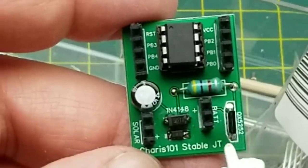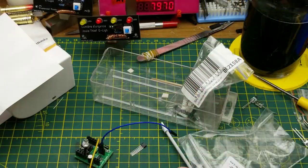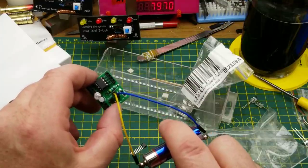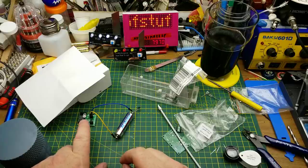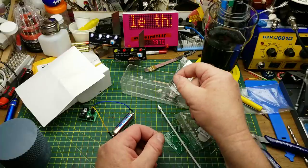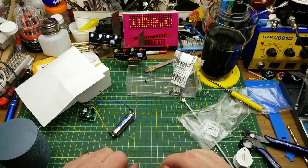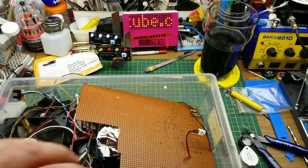It has a rectifier diode, a zener diode, a capacitor, and he's able to use that same solar charging circuit — there's a solar panel connection and a battery connection — to power an ATtiny chip. You can watch the ATtiny running the blink sketch off a one-and-a-half volt battery. I think that's pretty slick. The 5252 datasheet gives you some math to figure out voltages and currents, but I'm just going to throw one onto a breadboard and try it with fairly random component values — let me grab some salvaged parts.